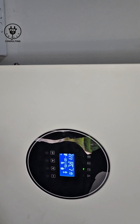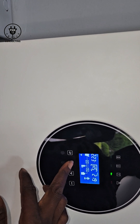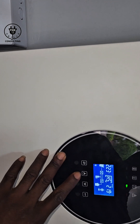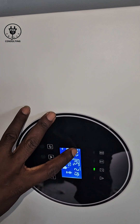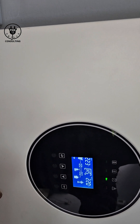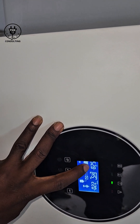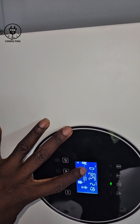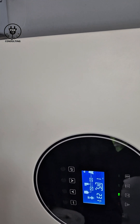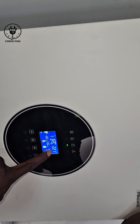These buttons let you navigate to check parameters on the display. The two buttons you use most often are just up and down. You can see the inputs and outputs: the voltage coming in is 223V from NEPA and what's going out is 219V from the inverter. Pressing down shows the input frequency; pressing down again shows the battery voltage at 52.8 volts; pressing down shows the charging ampere, which is now zero since it's no longer charging. This is a dual-MPPT inverter — PV1 and PV2 — showing voltage and wattage from each.